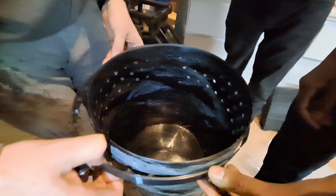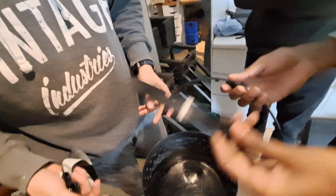In our second version of the tank, we approached this problem by creating what we called the seal protector. This is just a PLA part that we made, which would be fitted into the holes as we push the bulkhead into the tube. This would prevent the seal from bubbling out into the holes whenever it passed through the hole layers, which was causing the cutting in the first place. And that worked relatively well, and it allowed us to go to our second pressure test.